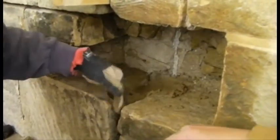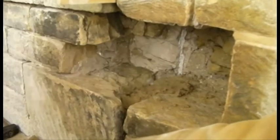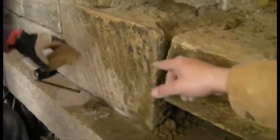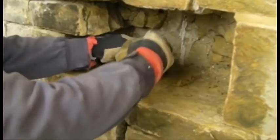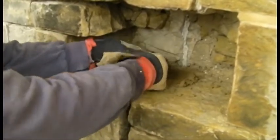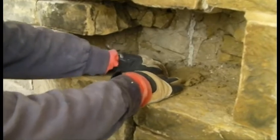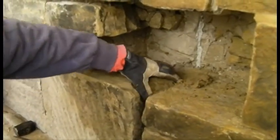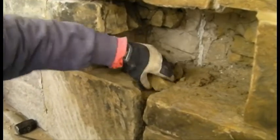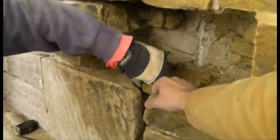Now we're going to put this other piece of stone right here — I think that's the one that fit right in that hole. We turned it a certain way and it kind of fit in there. Small pieces of stone and original mortar were inserted into the mortar and packed tightly around the bed and head joint areas of the cavity prior to setting the replacement stone.